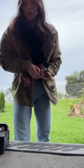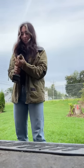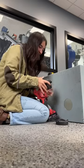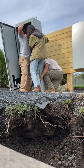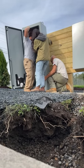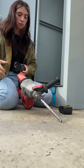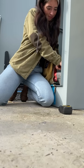Part two of the car wash outdoor service — one of the hardest parts. This job was scheduled for a Saturday because that's when the utility company could do it earliest. That cabinet I mentioned before, the one we were going to put the pipe on — it's for the VFD system for the vacuums, basically to control the speed and the amount of energy used. The VFD system is not NEMA 3 rated, so we need to find a cabinet we could put outdoors that would give us enough room to work in.